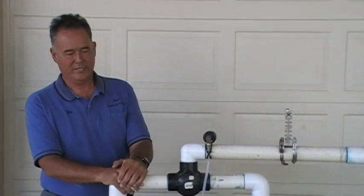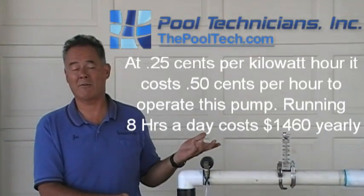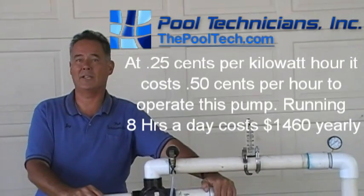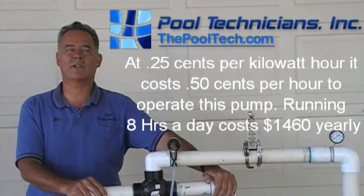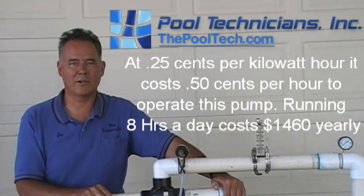2 kilowatts — what's called a kilowatt hour. If you look at your electric bill, it's written up in kilowatt hours used. Edison uses the number of about 25 cents a kilowatt hour. This pump is using 2.0 kilowatt hours, or 2,000 watts. The cost of that is about 25 cents per kilowatt hour, so if this is 2 of them, the cost to run this pump is approximately 50 cents an hour. If you have a pump like this and you're running it 8 hours a day, that's approximately $4 a day in electricity to run your pool.